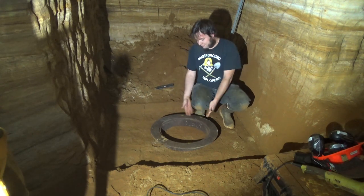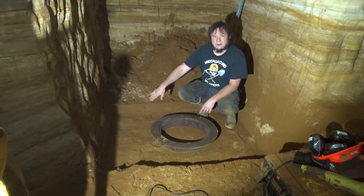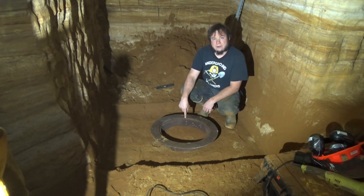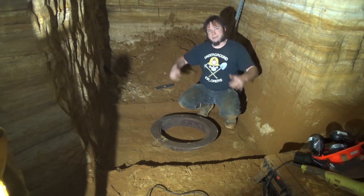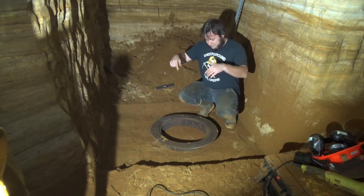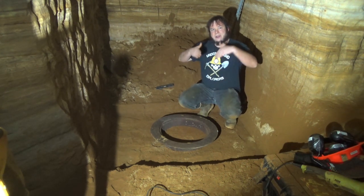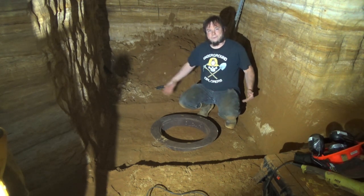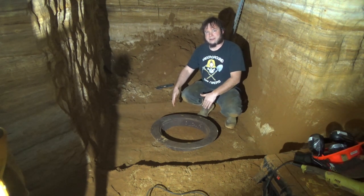The manhole itself is going to be hollow in the middle here — put the lid on top, and then once all that cement sets up we're going to start tunneling down through the manhole collar because it's just sandstone underneath. We can spread it out a little bit because this hole is not going to fit somebody my size — I'll fit through it, but once I'm down there I'm going to have to bend my knees, climb a ladder. So we'll have to bell out the shaft a little bit, and this floor will let us expand the shaft once we're underneath the collar.